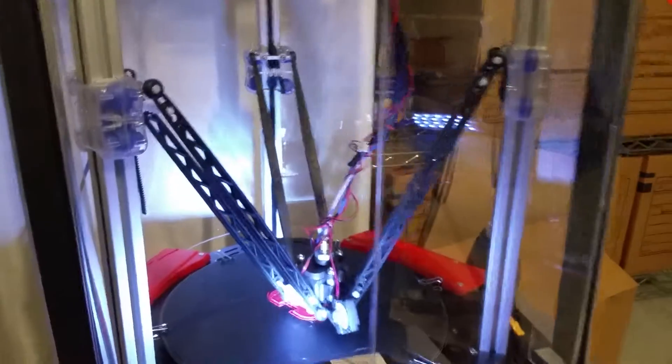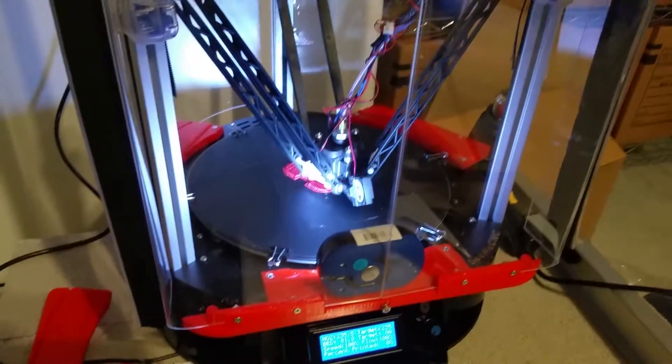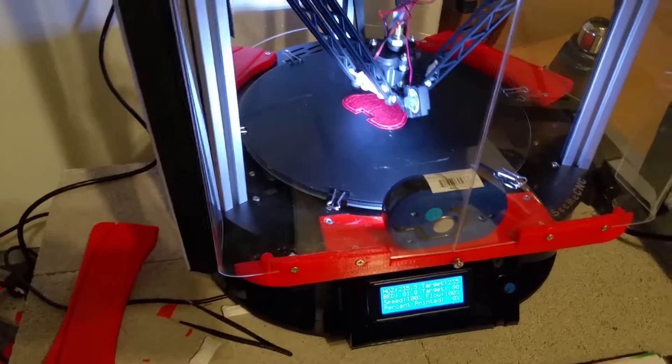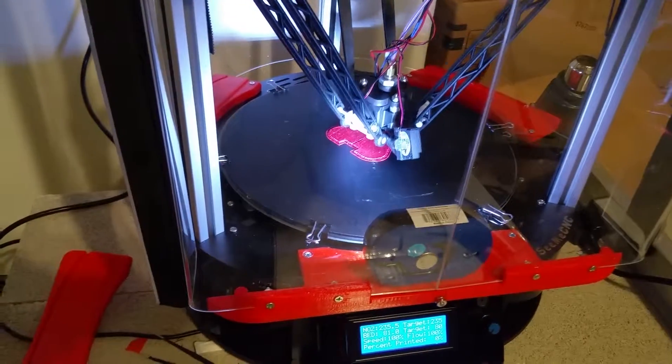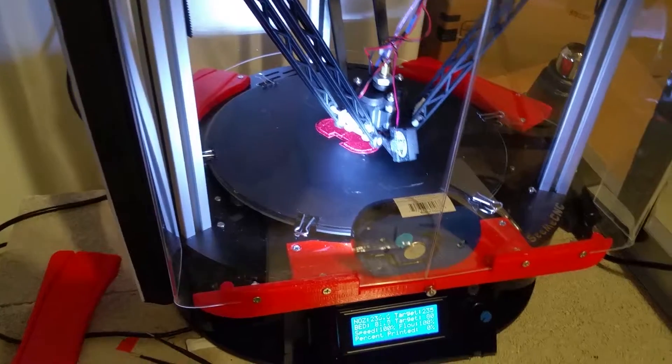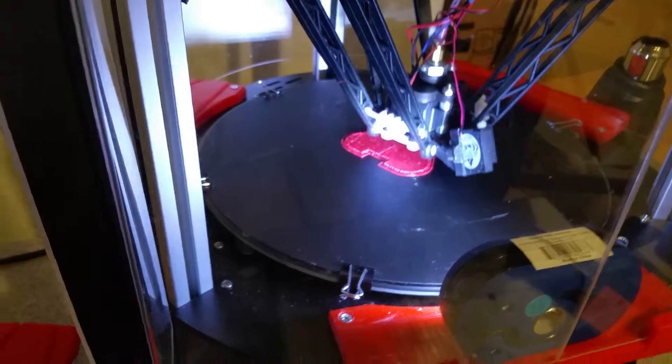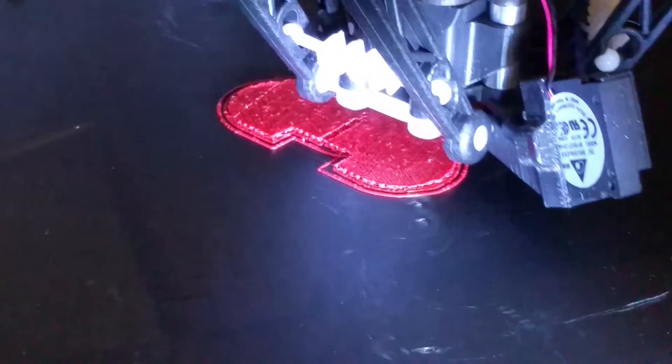I'm keeping the top on for the most part and I inserted a switch for the light. I have no other way to regulate it at the moment — if the temperature gets too hot in there, that's something I'll add in the future. I'll throw a thermistor in there or something to help regulate the heat once I figure out what the proper temperature is. The ABS coming out right now is really terrible — let me zoom in.